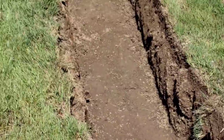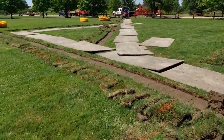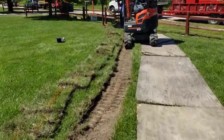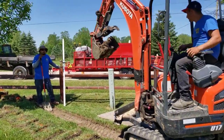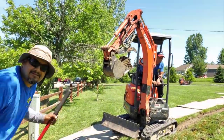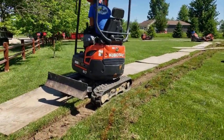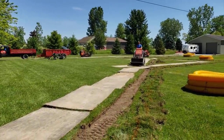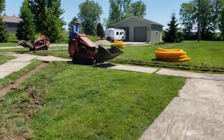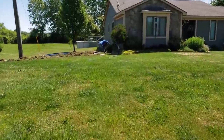We went up from three inches to four inch schedule 40 — and we're like that with everything. If we're doing a footing instead of 42 inches, you're going to see us pour a 50 inch footing because I've seen the frost get under a 42 inch footing. There was a ditch out front, but your ditch on one side of your yard is going to be higher than the other. That's why it's running on an angle and not a straight line down to the ditch — the ditch bottom was too high. We had to be further down the street, further down the ditch where we had more drop. We were using as much slope as we could possibly get using all the tricks in the contractor's handbook.